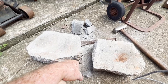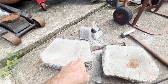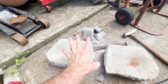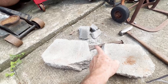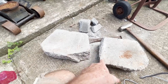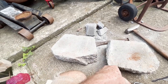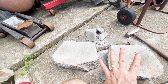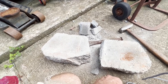If you had to cut it where it was going to be exposed — if you put a masonry blade on your saw and cut this, there will be so much dust. You really need another person with a little water bottle with a hole cut in it to squirt water on it and keep the dust down. If you do not, you need to wear a respirator. When chiseling: eye protection, eye protection, eye protection — cannot stress that enough. Do not do this without eye protection. The cloud of dust from a saw cut will linger on the air and can be traced right back to you.